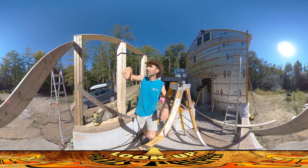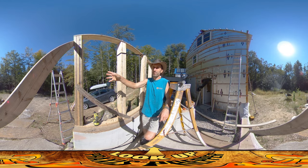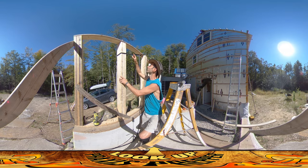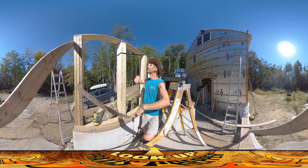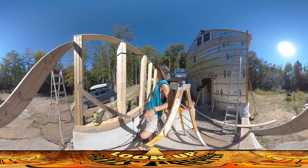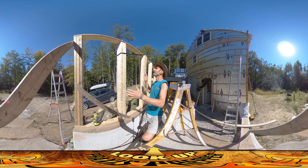This post here with the angle braces is rigidified — it's plumb, it's right where it needs to be. These other guys are kind of haphazard all over the place. I've got this thing all pre-measured out; I've got lines drawn right on the header, and I'm going to be pulling these into position and nailing them in one by one. Because this one's correct and the one at the end is nailed in and correct, it'll just pull everything into line.